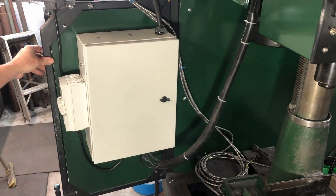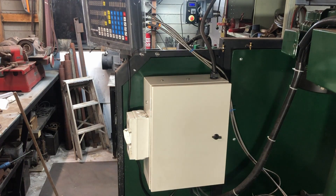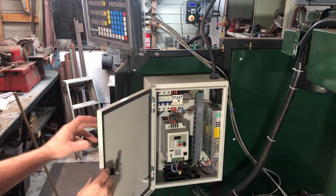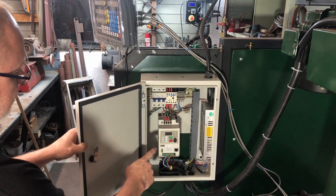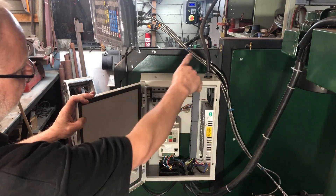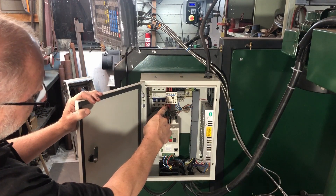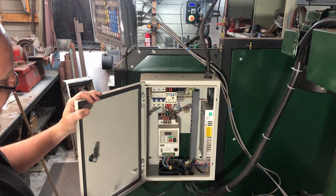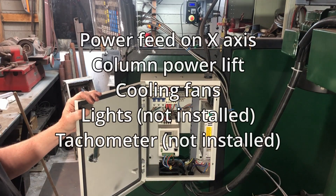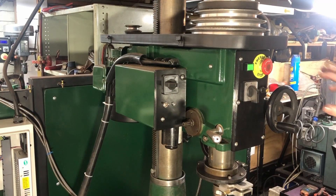On the other side there's the same design swinging door that opens up. The DRO is mounted to the top, and the electrical panel is bolted to this door on the side. There's an isolating switch here, and in the box we have all the electronics. I've fitted a VFD to the mill so I can have variable speed. It's three phase in, goes through the isolating switch, through circuit breakers and a contactor, into the VFD.